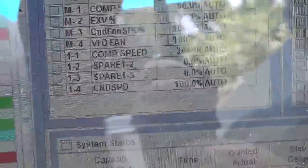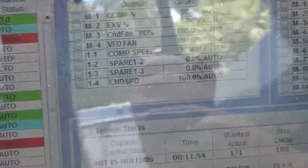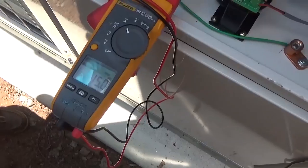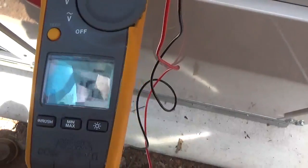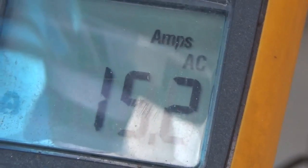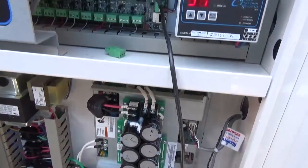This unit is also in direct sun. I'm only doing the cooling loop right now — I'll show the heating loop next. We've got a couple weeks before I get the heating side done so it can take advantage of the heat recovery. Right now we're seeing awesome numbers. We're experimenting with a circulating pump that's a little underrated to save some energy. We're running 20–22 degrees below ambient and keeping the whole house cool. On my Fluke meter we are pulling 15.2 amps at 230 volts — absolutely wonderful compared to the old heat pumps I've had.